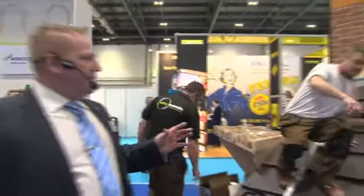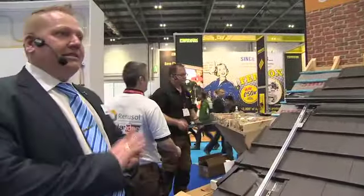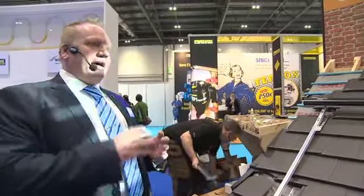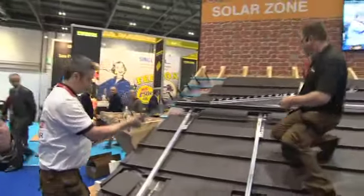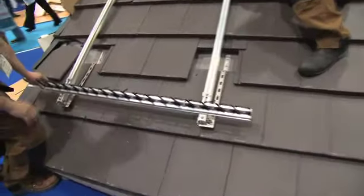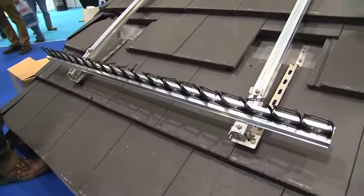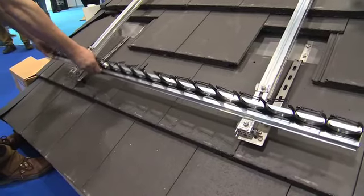Now, there is one special thing that we have with these tubes: a temperature limiter in the top of the tube itself. That allows it to get to 95 degrees in the tube. In reality, we try not to stagnate the system, because as you stagnate the system, it's inefficient. So we try to make sure that we can pump the fluid around the system at a temperature that we can control and then transfer it.